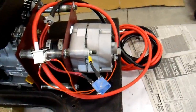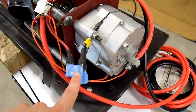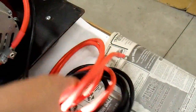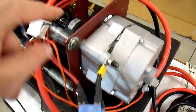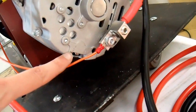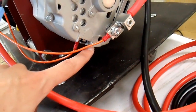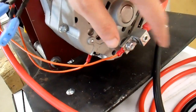Here's the largely completed wiring. I need to secure things down a little bit better to make this permanent, but this is good enough for testing. I actually fused the ground, just because it worked out better on this one — I'm not setting this in a vehicle where it may contact the chassis, so that works just as well as fusing positive. I have them hooked up to the 4-gauge cables. The negative goes through the fuses to the connector and out; the positive comes straight out of the alternator. There's a 1 and a 2 on this 3-wire alternator. The reference terminal you could wire all the way out to your battery, but this alternator is set at too high a voltage anyway, so I'd like some voltage drop in the cables — I'm leaving it open, and it just internally references the output terminal.